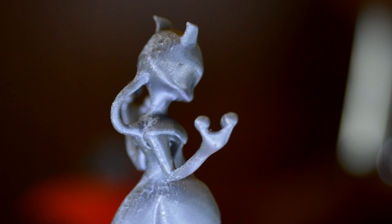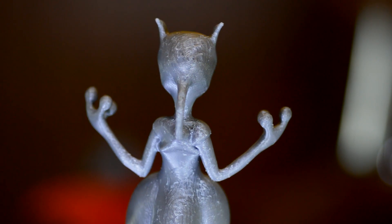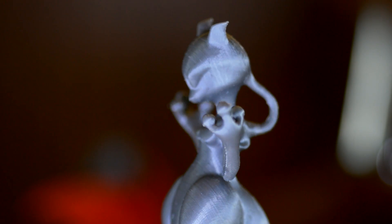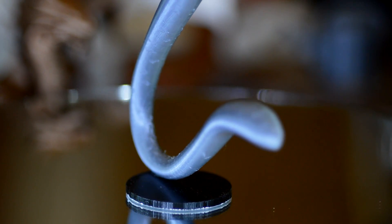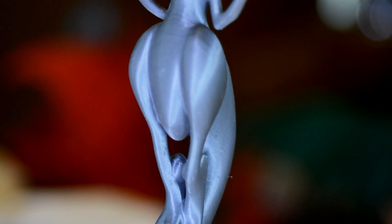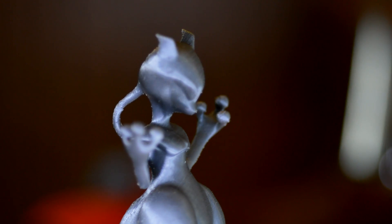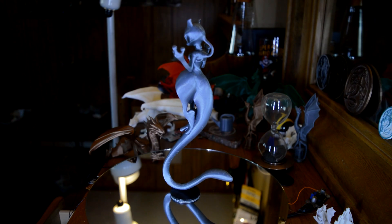There's quite a bit of artifacting on the back, but that doesn't really matter because you're not looking at that. There are some artifacts from the overhangs on the back of the tail, likely due to incorrect temperatures or layer cooling — the layers are probably curling up a bit and then the extruder mushes them back down, causing periodic scuff marks. That's how it came off the printer with no support material there. Nonetheless, I'm very happy with how this turned out. Maybe I'll print it again scaled up, but that's this 3D model 3D printed. Thank you for watching — if you have any questions, feel free to ask in the comments, and I'll see you next time.